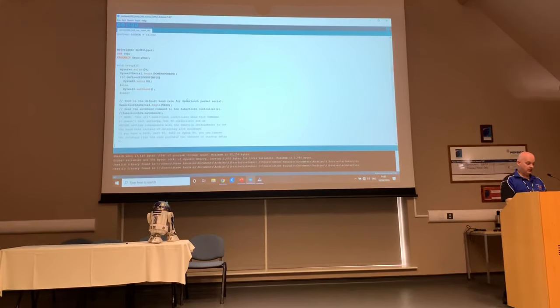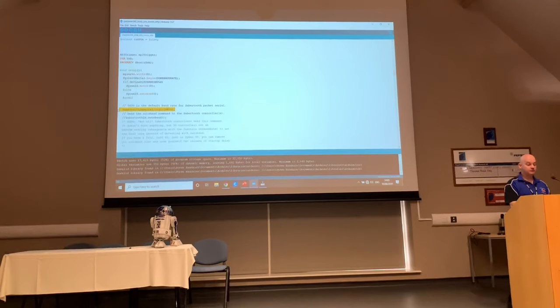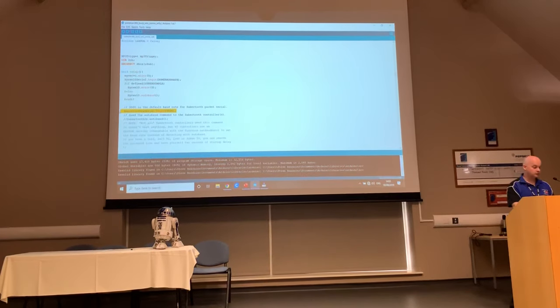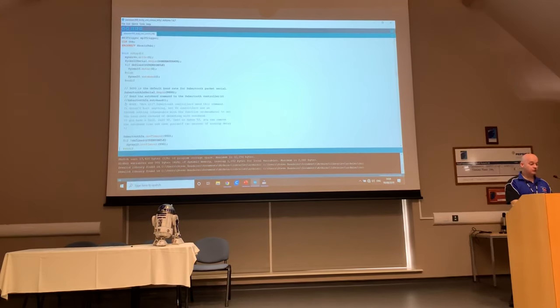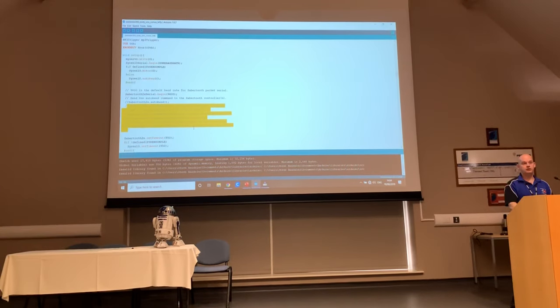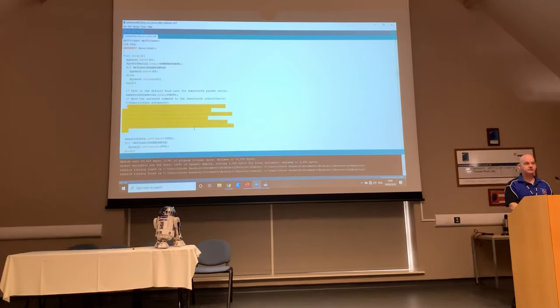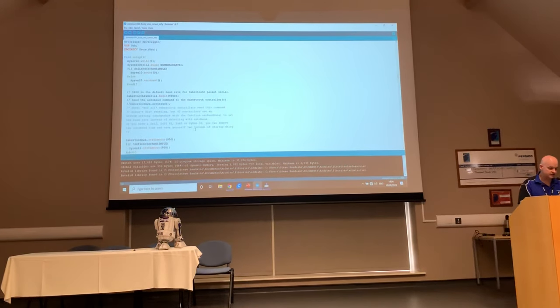So on mine, I then tell it to actually begin communication with the Sabertooth at 9600 baud, which is a common speed to talk to serial things. And again, all of these comments here have been written by Dan. Very, very useful. So have a read of this stuff. It's written in plain English. It's nice and easy to understand.